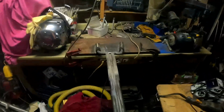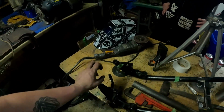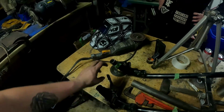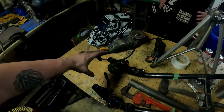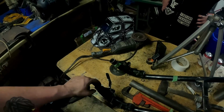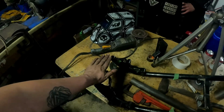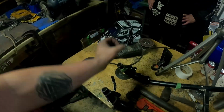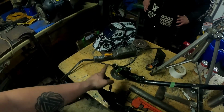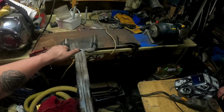That might be what I'm going to have to do, because if this is just straight across, say if I were to have a mandrel and bend tubing, instead it'll just be a solid piece of bar right there, plus the slugs exposed. Then I can fill those up with weld, smooth them over, and that way it'll still have all the strength downwards, and then sit it on top of that and just scallop it to the same diameter. So that way I can still utilize these bends here, just straighten them out somewhat better.